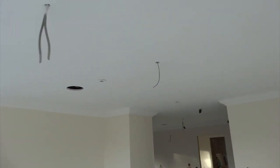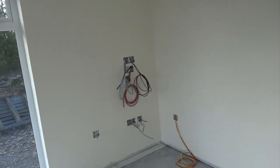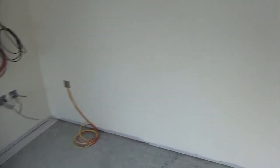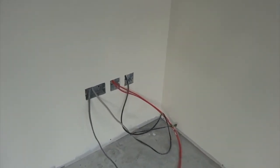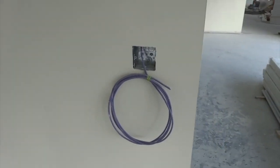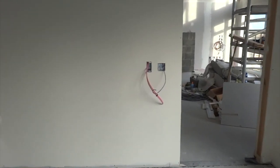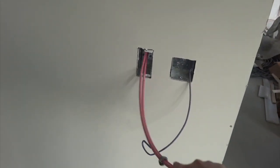A couple of speakers up here above the dining area. PIR, kind of centrally located to get you as you come in from the sunroom which is over here. We've got another TV pre-wire, a couple of voice data points here and on the rear wall, and our media input in the corner. There might be fitted joinery here so that will be hidden really nicely. Again, push button light switch there. There is also a pre-wire for an additional zone — this is speaker cable — which will be a simple rotary knob as opposed to the digital Russound, and it only needed one additional zone.